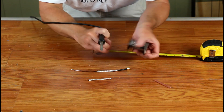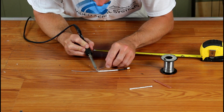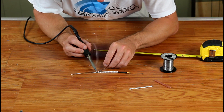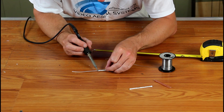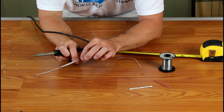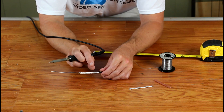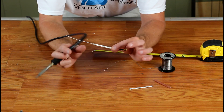Now it's time for our soldering iron — let's solder this in place. Be careful here: you do not want to use an excessive amount of heat, just get it bonded. The reason is the heat is going to track down and shrink up that internal heat shrink tubing. The entire purpose of that heat shrink tubing is to create an air gap — you need that to be there. It is absolutely critical, because without it, this antenna doesn't work.